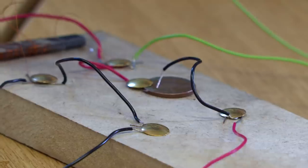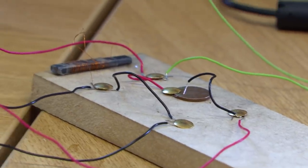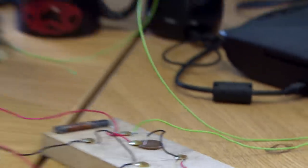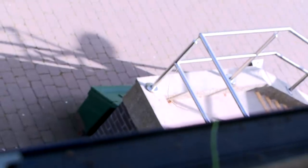And this is all coming out of a tiny wire, and a penny is acting as a diode, rectifying the signal. We are picking up a station called Absolute Radio all the way from London on a piece of wire hung out of my office, which is acting as an antenna.